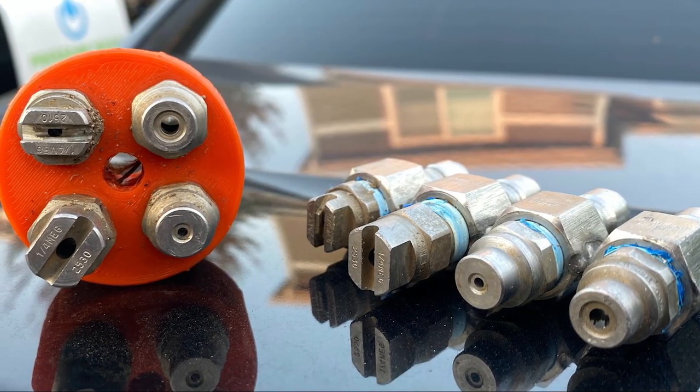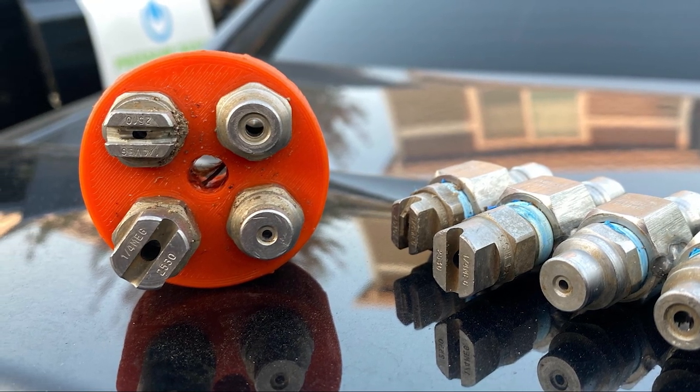I want to go over some key points about the Quad Rod and do some comparisons with the J-Rod. Looking at them, they have the same tips, which is good — these are the tips we need in this industry. You have one tip for a lot of water with a wide mouth fan spray pattern, a tighter fan spray pattern that's a little more pressurized, then a shooter nozzle that gets far and puts a lot of water on the house, and then a higher pressure shooter nozzle — kind of like a red tip but not as aggressive. Both of these have all of those available.